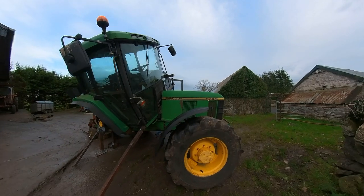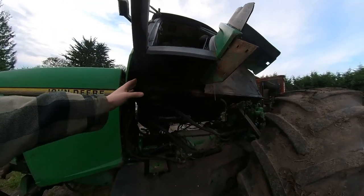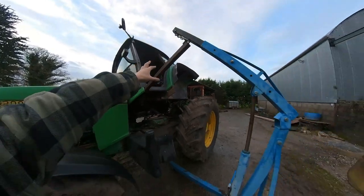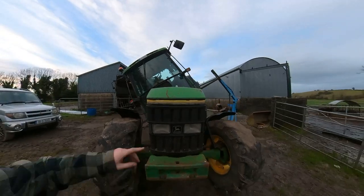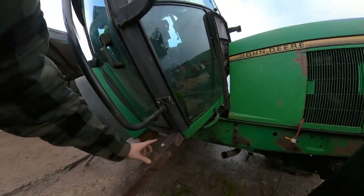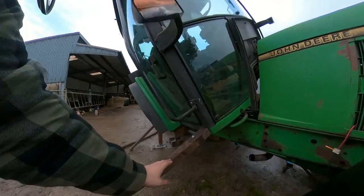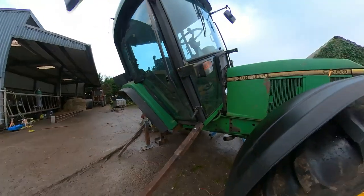Working with tipping it with the engine crane here. You can see the frame of the cab is made of box section, 60mm box, and your 2-inch 50mm box will slide right into it. Then I ended up pushing that all the way through, and it's sticking out here about 8 inches, 200mm, and this sleeved leg will slide right onto it and be bolted there with one bolt.